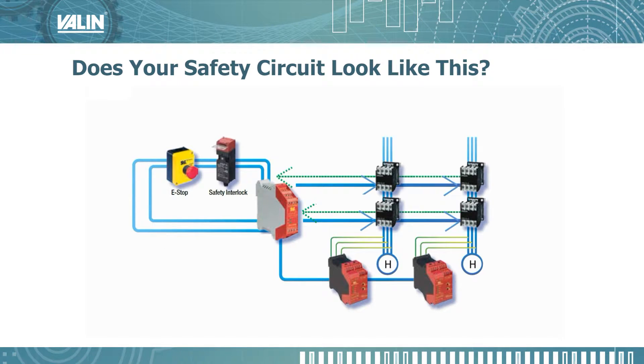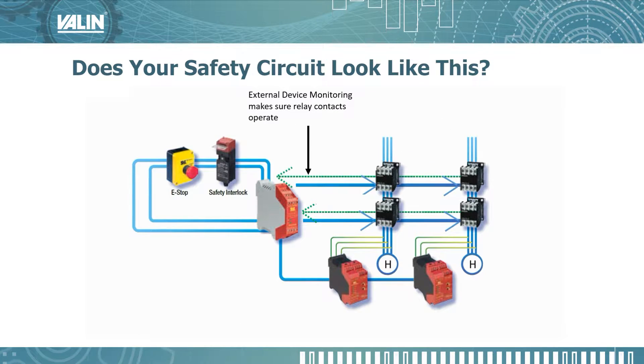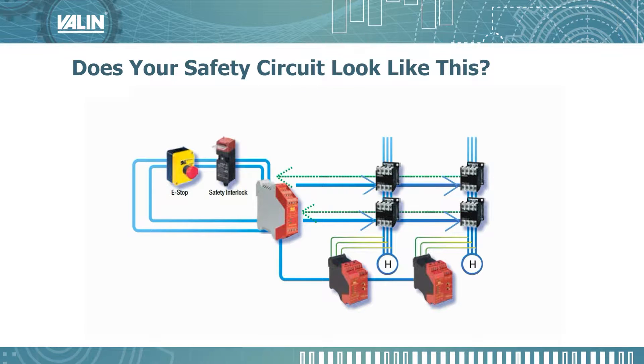Here's a picture of what we would consider a simple safety circuit. There's dual channel wiring for redundancy that goes through the e-stop and the safety door interlock. You have several force-guided relays to kill power to the hazard. The hazard could be a motor, a pinch hazard, or any moving part that can affect the operator. There's external device monitoring wires for these force-guided relays so that you can confirm the operation of those relays. There are also some additional monitoring relays that monitor the hazard and give an indication when it's safe even after you've shut the power — for instance, a motor that has to run down. It'll monitor the movement and then give a signal back to the safety monitoring relay to let you know that it's safe.